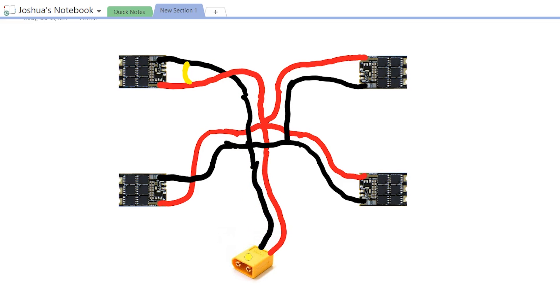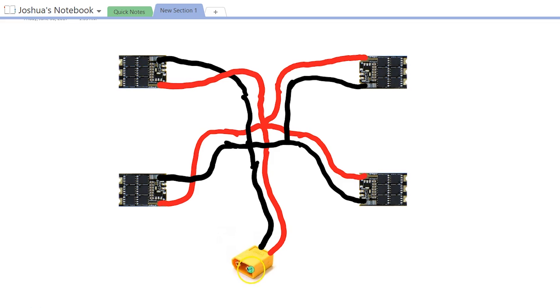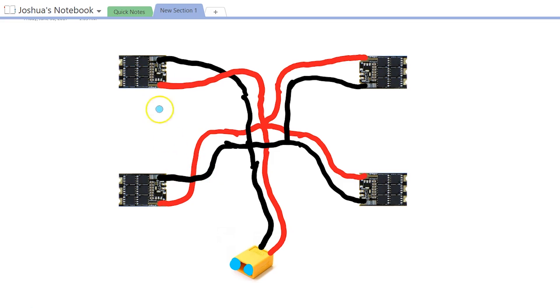What I want you to see is that regardless of where the short was, the effect is going to be the same — it doesn't matter exactly where I put it. From the perspective of the battery, current goes in and takes a low resistance path right back to ground. That means it's pretty hard to tell where the short is when you measure continuity with your multimeter. If I were to measure continuity right here at the battery lead, the multimeter would beep and tell me I had continuity, but it doesn't tell me anything about where in the circuit the continuity was.